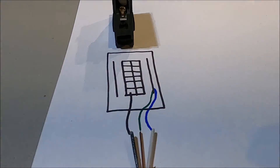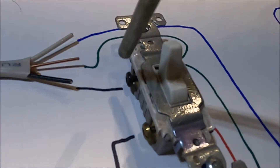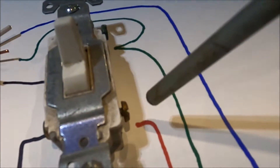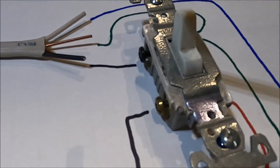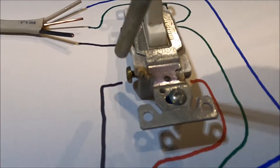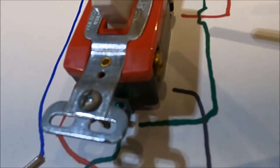These wires could have easily been put over here as well. So we have our breaker, and you'll see the black wire travels through the Romex up to the first screw. On a typical single switch you'll just have two screws on the side, because you're just controlling the black wire. But on a three and four-way circuit you need special switches. You know it's a three-way switch because it has the black screw where the power comes in and two screws at the bottom for your traveler wires. Then on the next switch you have four screws.